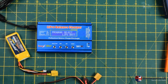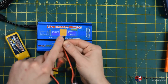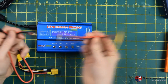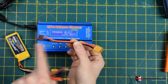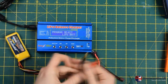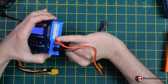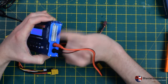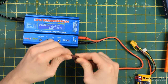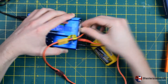We'll start from scratch. So you've got this plugged in. In the box you will find a whole bunch of leads, and normally the modern B6s — as you can see here, this has been machine heat-shrunk — will come with a Deans to XT60 connector. You need that or you can make one of your own; older versions don't come with this. You'll also need the barrel plug to Deans male connector. The barrel plugs go in on the side like so. This array here is your 1–6S balance charging array, so your balance plugs on your batteries go into those plugs there. We connect all this up — this is a 3S LiPo I'm charging here.